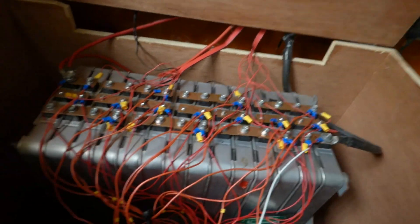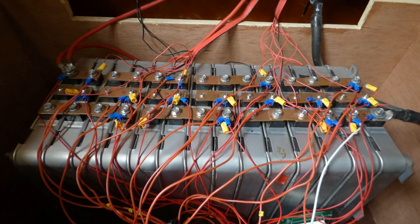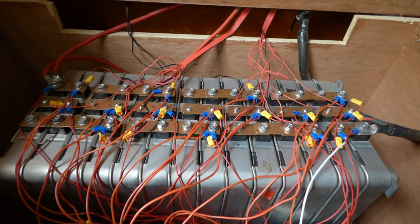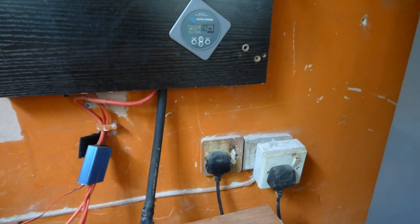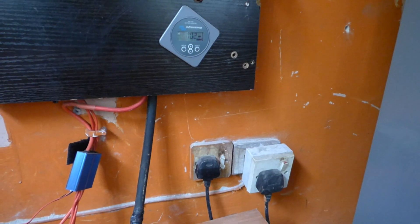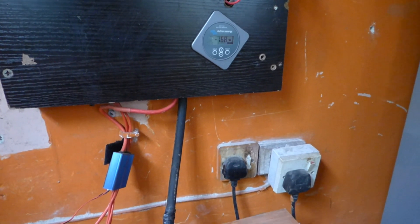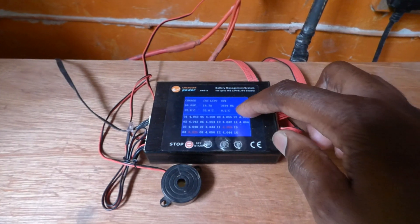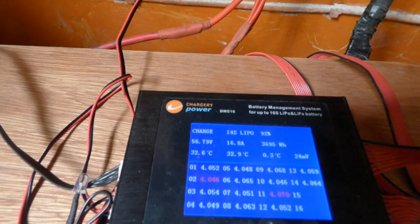My trusty Nissan Leaf batteries are still in use and doing what I expect them to do. I did a capacity test yesterday — I fully discharged them and took 66 amp hours out before it shut down. My shutoff is set at around 51 volts. As you get closer to those numbers, the cells start to drift and the voltage difference between cells increases, showing that some cells don't have the capacity of others — which was the reason I bought the balancer and equalizer.